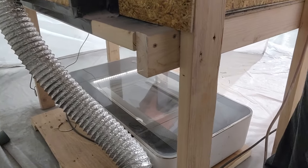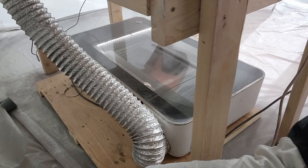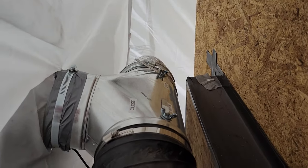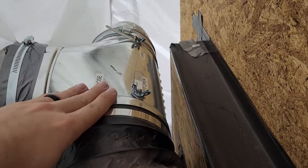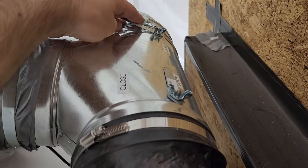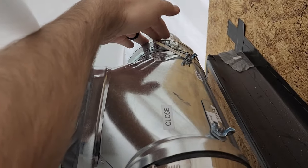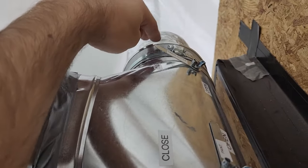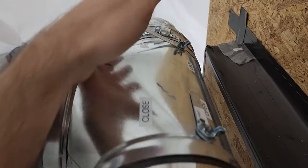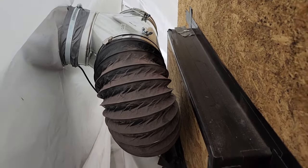We recently had to fork the ductwork off for our laser cutter. The laser cutter uses four-inch piping instead of six, so we had to convert that. We basically made a T-intersection and labeled each side so we know this side is paint and that side is the laser cutter. Inside each of these ends we have dampers, which change the airflow. We want to be drawing from the paint booth when using the paint booth, and from the laser cutter when using the laser cutter. The paint booth is currently marked open and the laser cutter is closed, which saves air draw and makes sure we're not wasting suction on both sides at once.